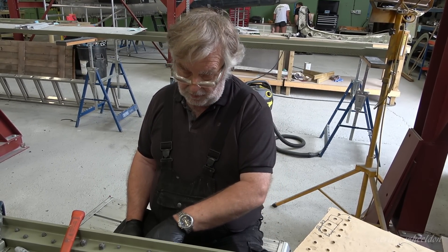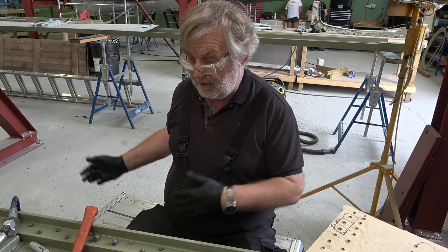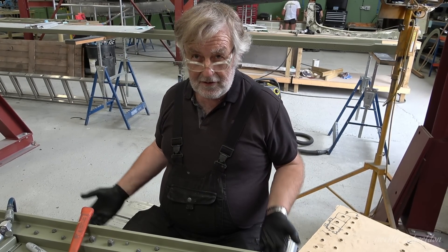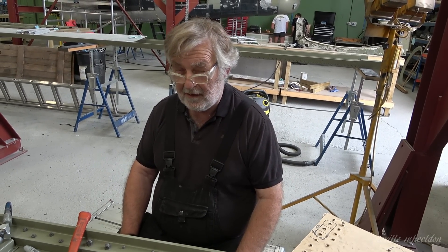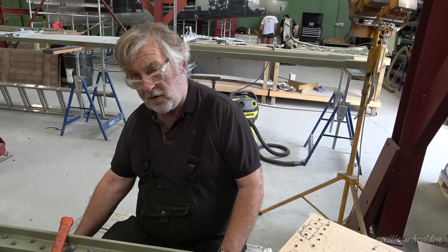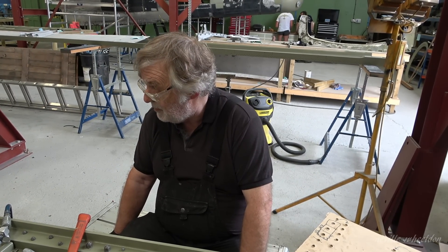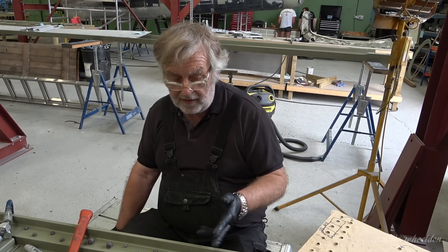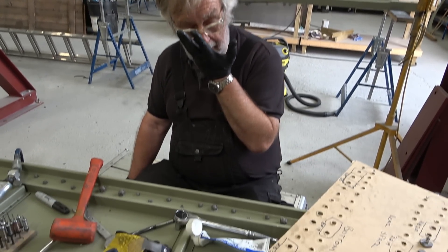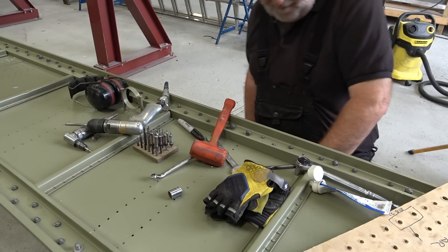So we've had to re-drill the holes for now. When we do the proper airworthy ones, we'll get some new plates. We've decided that instead of putting the wing in the jig to strip it, it's going to be stripped out of the jig and then only use the jig to assemble. The French right-hand wing was actually bent where it collapsed — the gear collapsed and went down, bending the wing spars — so you can't reuse that as a datum for lining the jig up.